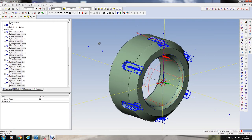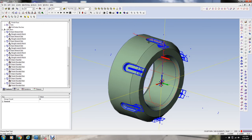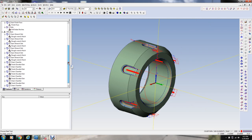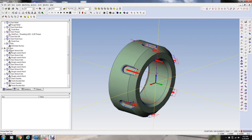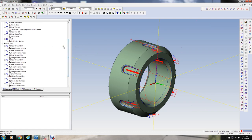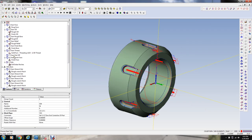And it'll rotate the B axis now to 90 degrees to come in here. You could have any angle you want. If you have these work planes or your milling coming in at different angles, it would position the B axis appropriately. If you don't do that, it'll be dealing with all of this as if it's five axis cuts, and so it'll just be X, Y, and Z movements. And it won't necessarily go to the place you want unless you actually put a five-axis compensation on the toolpath. Then it might work, but this way it works better. And it also can use cutter compensation for radiuses and such if you do it this way. So that's all of that. But then we want to go back to this work coordinate system here to do the parting off operation, which is right there.